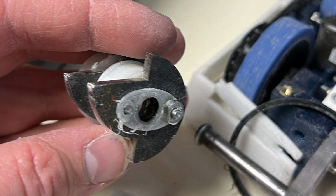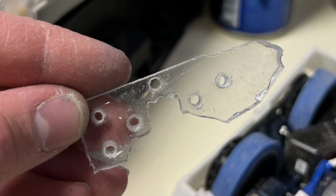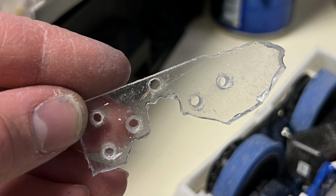Being an early round fight, I assumed that I probably had a decent amount of time to my next particular battle. So instead of throwing the alternative robot into combat, I went ahead and fixed the one that kind of got beaten up here. And another piece of damage I did discover was that one of the bearings inside the weapon system here, there's a little bearing that's actually inside each of the tiny little weapon blades. One of those shattered, so I had to replace that on top of fixing the weapon cage.